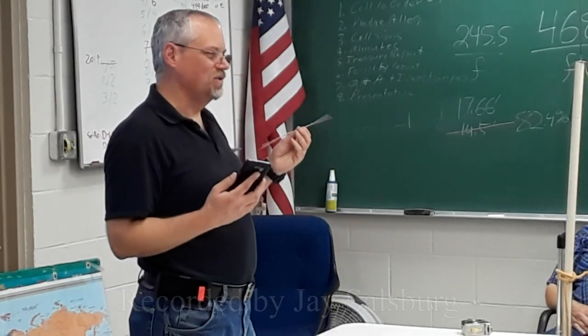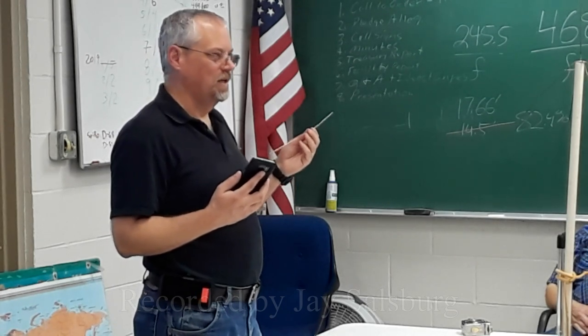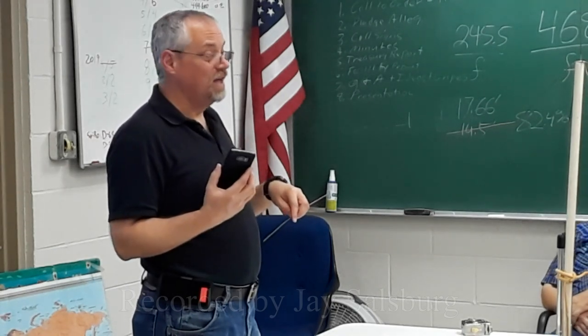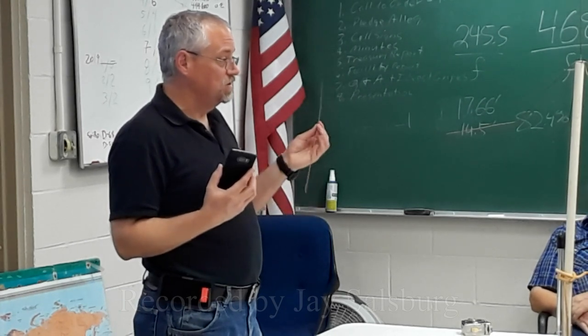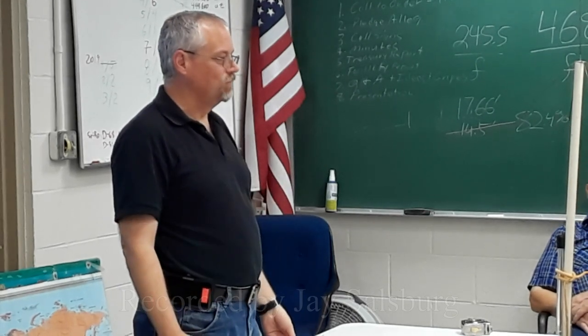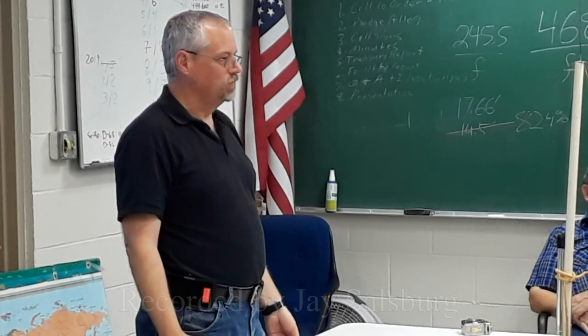So I don't think it's going to be an exact match for that. Maybe there's something else going on. It should be an odd number. Well, 9. Yeah, 9 of these. That could fit if you're going to repeat the impedance of the antenna at your source, if the feed line has to be an exact number of odd quarter wavelengths.